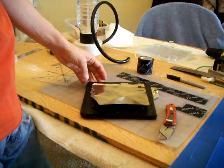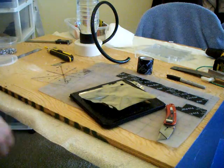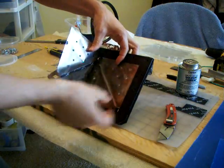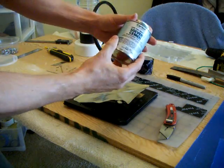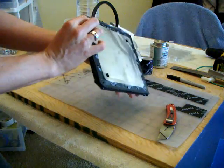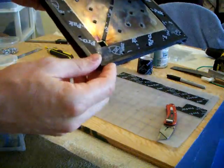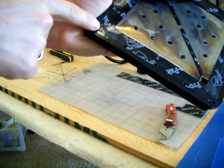I'm going to do this with, as I said, that here. Oh yeah, the other thing here, to seal each corner of the gasket, because it's just striped, I use the solvent cement for PVC pipe. With my finger, I just sealed the joint between each of those things here, and it did a pretty good job. I don't know if you can see, but it's pretty well sealed. In this case here, you cannot even see the joint.